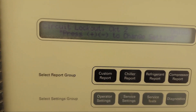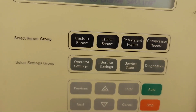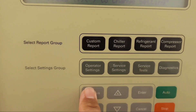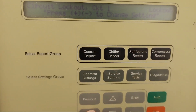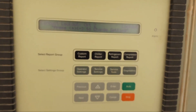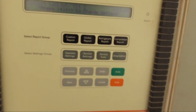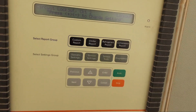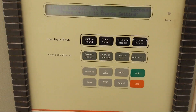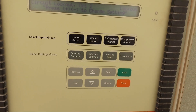Circuit Two is currently showing Unlock. If you want to lock this one out as well, press Plus and then Enter. You can check: Circuit One is now in Lockout and Circuit Two is also in Lockout. If there is a problem in one circuit, we can lock it out and run the other circuit in emergency cases. Otherwise, we should repair the faulty circuit and then run the complete chiller normally.